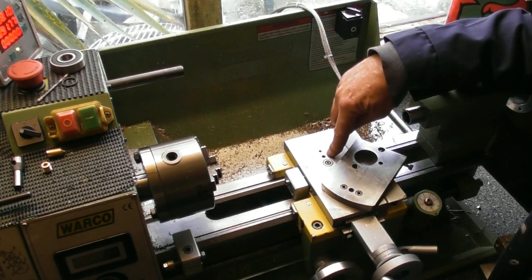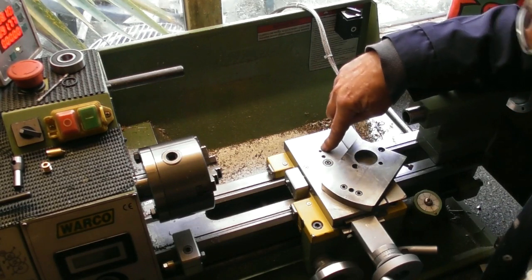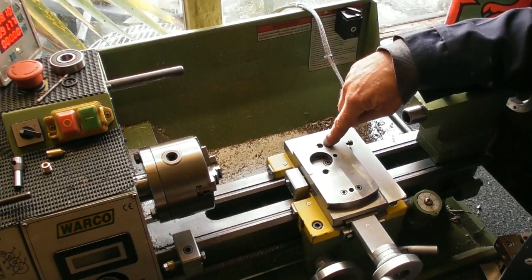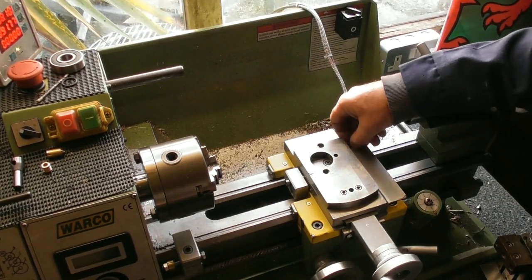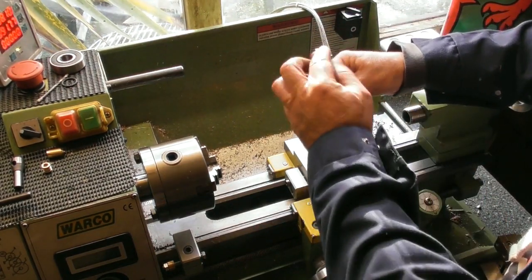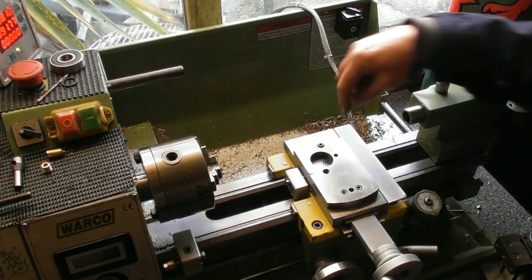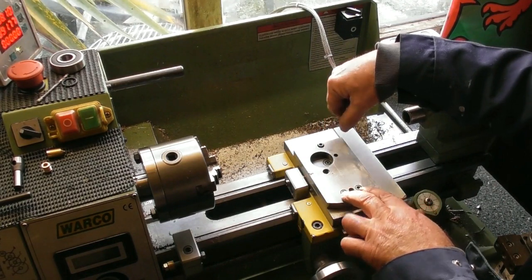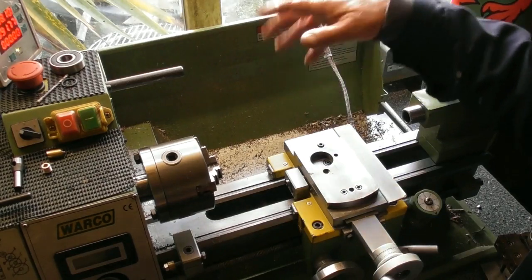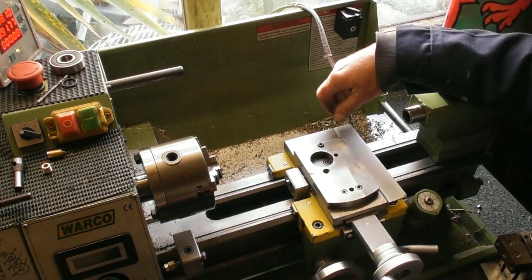Avoiding the little holes and the lead nut and the adjustment screw, I've drilled and tapped beyond that in a safe area another M5 thread — a counterbored hole for a little M5 Allen bolt. As you can see, I've then got a three-point location for my plate. When I drilled the hole in the bed I had these nipped, clocked up the spacer so I knew I was square, then spotted through, drilled, tapped, and clamped it down. It runs within about a thou on that spacer — square to all the travels.